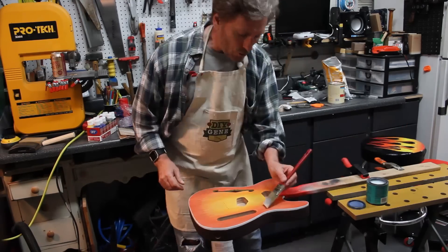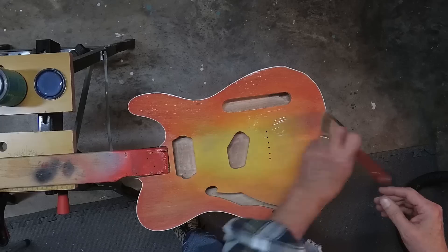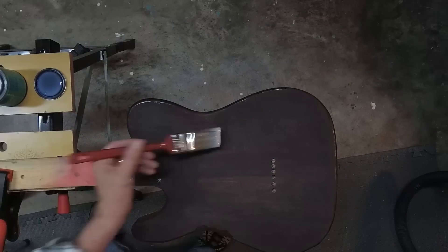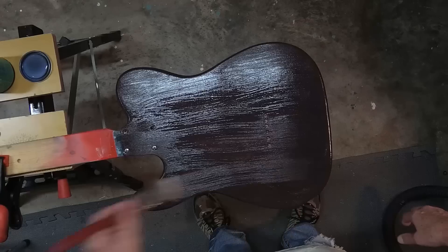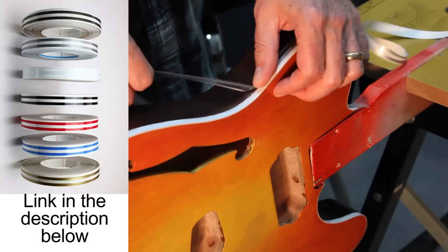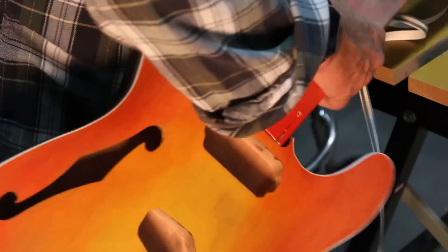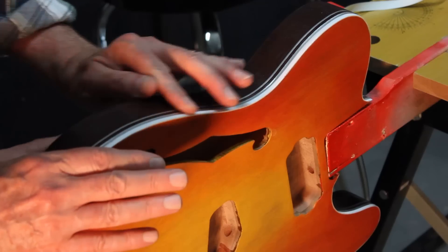Now we can start applying the Polycrylic clear. I'm using just a fine bristle brush and applying a very simple coat to the front, then flipping it over — I've done my edges — and putting a coat onto the back as well. After getting my coat on, I have to say it is splotchy looking. I'm going to apply some pinstripe tape around that edge of the lower part of the banding where I just wasn't happy. This gives it a unique look, and I like how that's going on. I waited to put this down between one of the clear coats because I want to come back with more coats over the top, basically locking it into the paint.